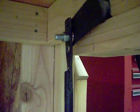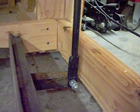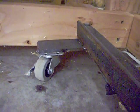What the lever does is you push it down right there — it pulls that rod up. As it pulls that rod up, it lifts up on that lever there, which is attached to this pivot which has the wheels attached underneath the bottom shelf. I've got the bottom shelf off so you can see all this. Watch that wheel when I push down on the lever — it raises the table up ever so slightly.